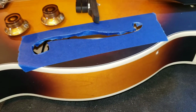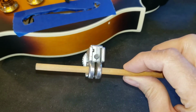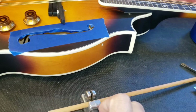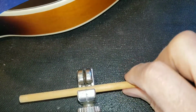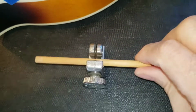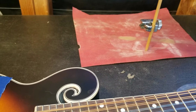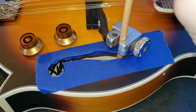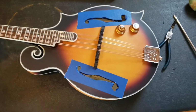So one time a person asked me, how do I cut the dowels? And this is pretty much it. It's a little copper tubing pipe cutter, and I just usually with two hands, give it a little twist, tighten it up, little twist, and then when I get to a point where I can just break it off nice and cleanly, I run it over on the sandpaper, and then I have an appropriate sized dowel. Okay, then we are done.